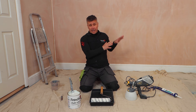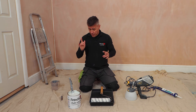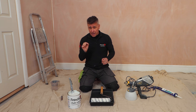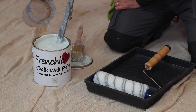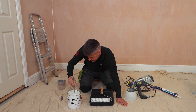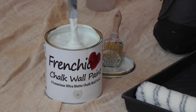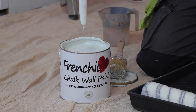Now with us painting directly onto bare walls, we've scored them a little bit with the light sandpaper. What I want to do is dilute the first coat down just a little bit — just five or ten percent water. That will just help that first layer of paint penetrate into the plaster and grip onto it that bit better. It only has to be a small five percent of water in there. Mix well, and this is the kind of consistency you're looking for.